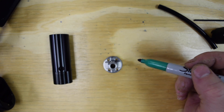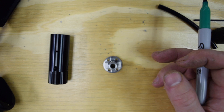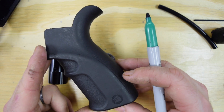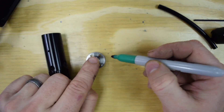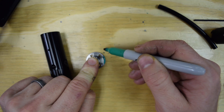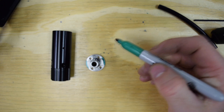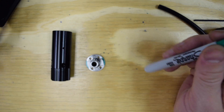A lot of brands, that's not the case. For instance, the PTS Magpul style grip — that one works great. We've tried them on Amoeba and a bunch of others and they work with no problem. But if you find that it doesn't want to sit all the way up inside, you may want to try a different grip. Or if you want to get a little creative, you can take a Dremel or a mill and just put a flat on the side right there, trim that back, and do the same on the opposite side. That's the section that's causing trouble. We're going to make a design change to integrate that moving forward, but that's how you would go about fixing it.